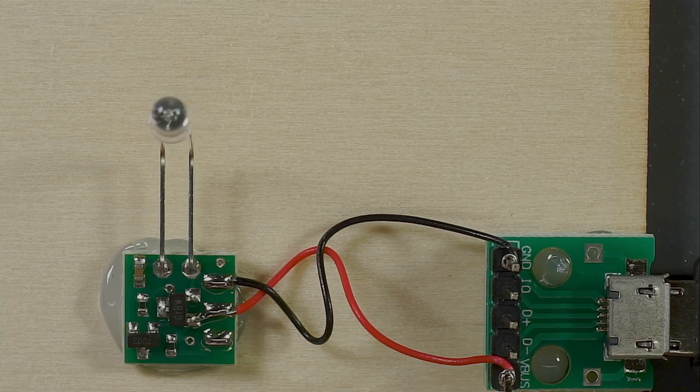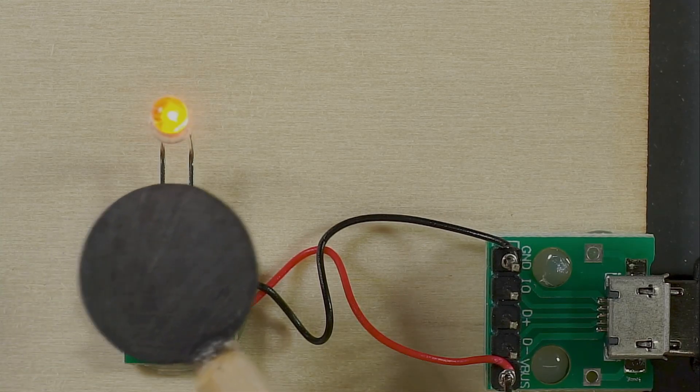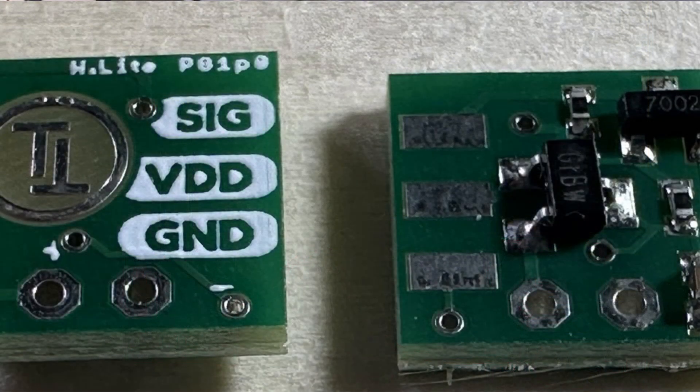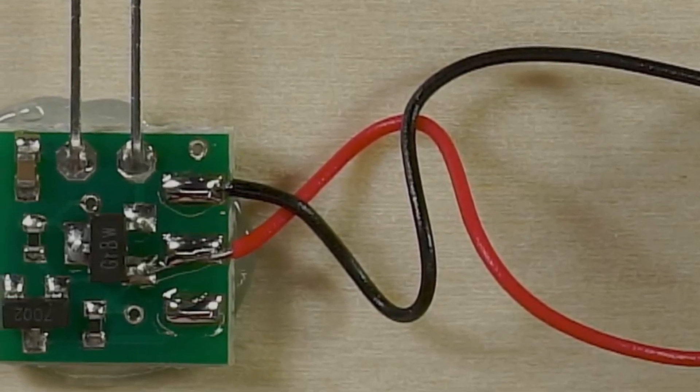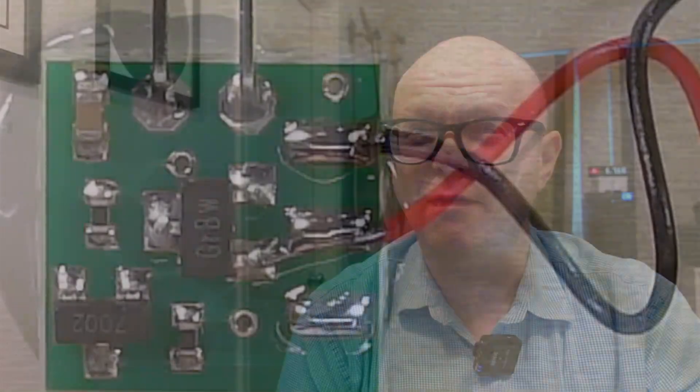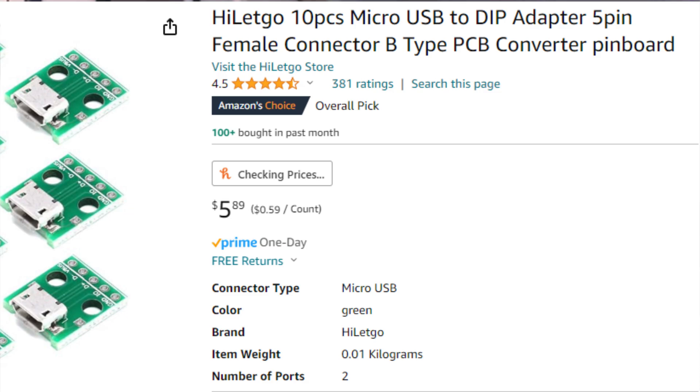But the difference is this doesn't have a battery on it. It's got three little solder pads on there. The board actually has two pins for an LED, so if all you want to do is have a simple LED on it, solder the LED in those two holes, solder some power up to up to five volts. So you can use a coin battery, a little holder, or you could use a little USB connector like I like to use.